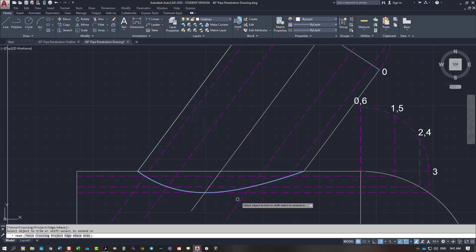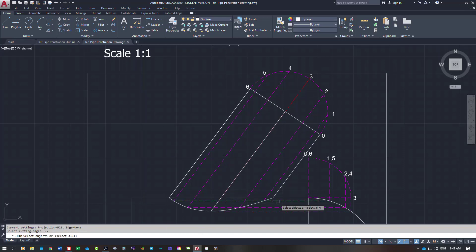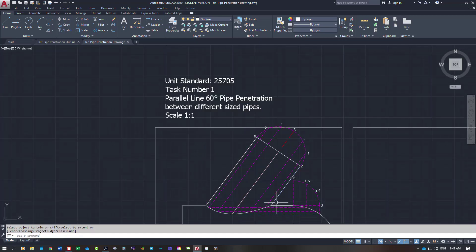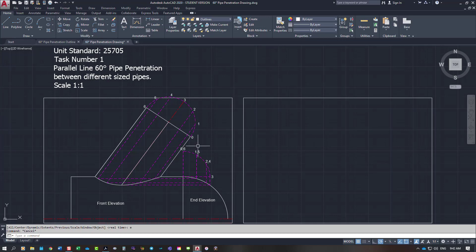I'll trim out those extra lines. On the back face we wouldn't see those lines anyway. The distance between where we can see the pipe — that line's gone. So our effective joint line is complete. In your case the pipe is 100 millimeters OD minus a material thickness which gives you 95. There's our joint line — that's what we had to determine first to develop the pattern.